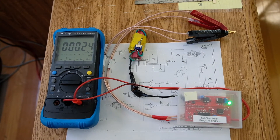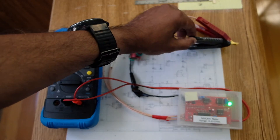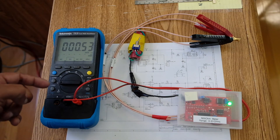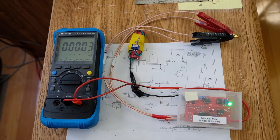Here is the updated milli-ohm meter with proper cabling — a four-wire clip connection. The zero value output is less than 1 millivolt, meaning the offset is being cancelled. Without offset cancellation, these op-amps could easily have a few millivolts of offset which, amplified by 10, could reach 20–30 millivolts or higher. With pressure on the clip the reading drops even lower, indicating some contact resistance. As connected, the reading is in the range of 700 microohms.